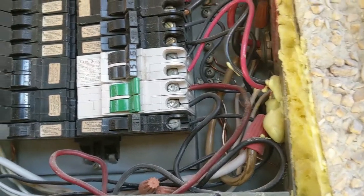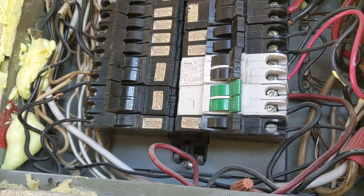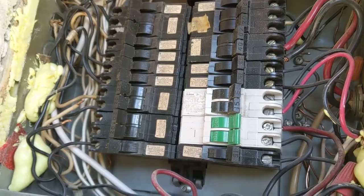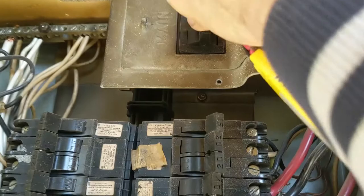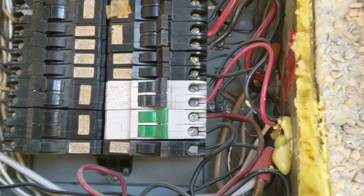I'm gonna pull those two wires — 12 gauge wire for the heaters. Wire is off. It's not the wire that is a bad connection, just the breaker is not working. Then I'm just gonna pop this guy on again and you guys can see the breaker is not going all the way through.